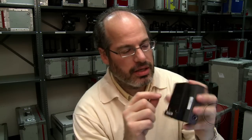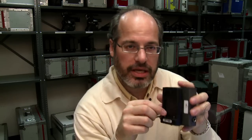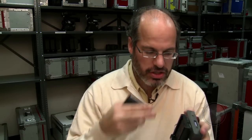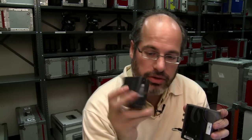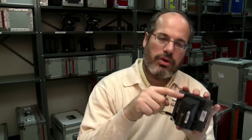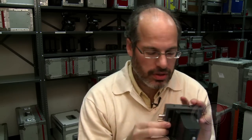So we talked to Nebtec, and Nebtec makes this special battery plate. It's not just a battery plate — it actually has a circuit board in it, and it's plugged right into the box here. This converts the power coming out of a camcorder battery — this particular one's Sony, but you can get it for Panasonic, Canon, and other brands. It takes that 7.2 volt power out of the battery and turns it into 12 volts. You can see this little LED lit up right there — it's fully powered, a self-contained unit. The regulated power from this battery plate is about 12.1 volts max, well within the 15 volt maximum range.